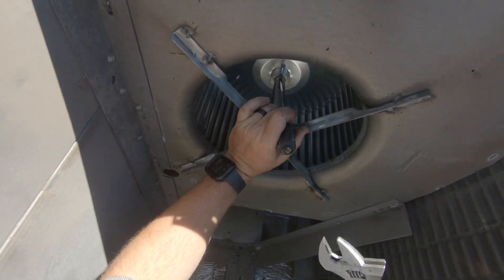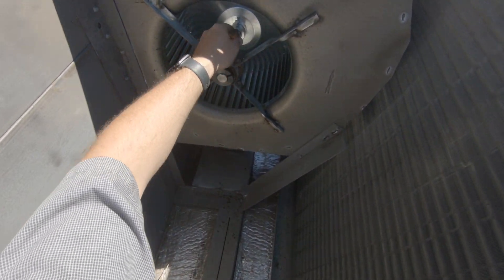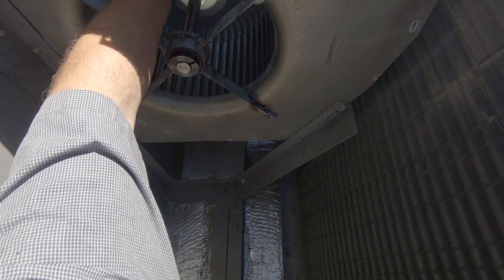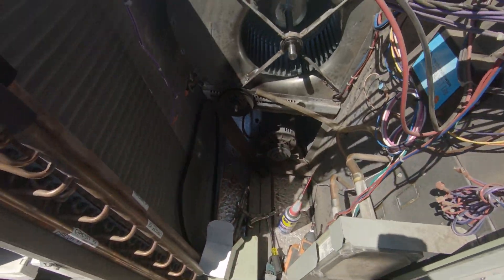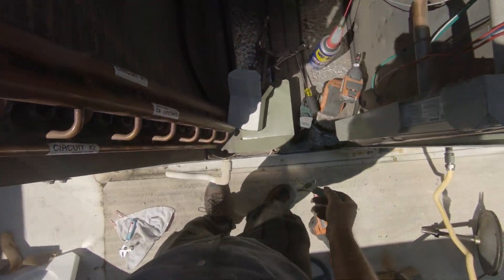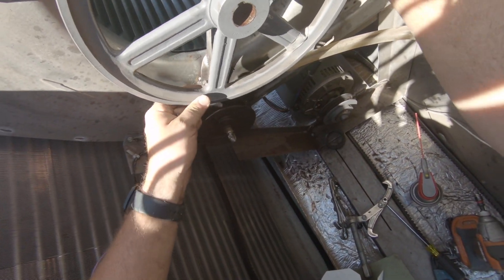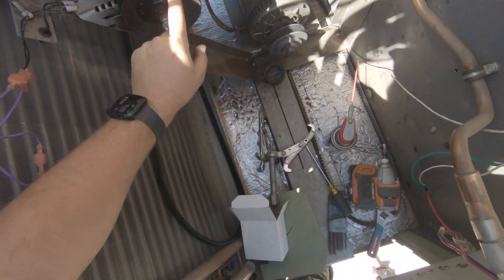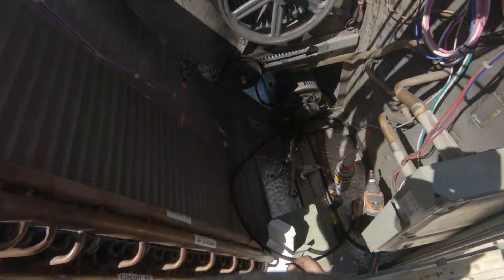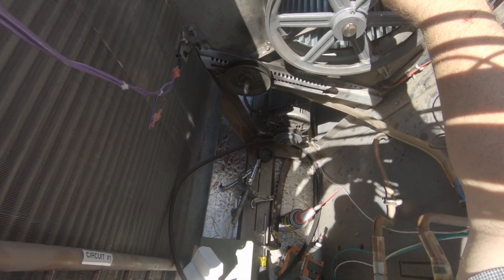This second key will probably be the difficult one. Oh, look at that — okay cool. We got our keys in there, so we're gonna go ahead and crank these set screws down. She's in there nice and smooth. Now we need to put our pulley on and make sure we line it up with the other pulleys, then crank it down and we should be good to go.